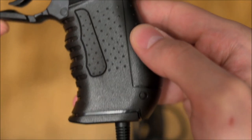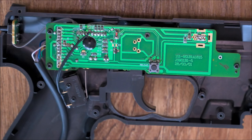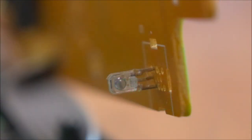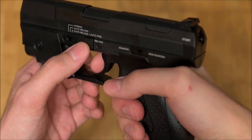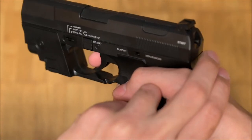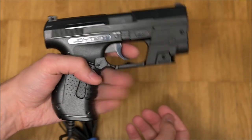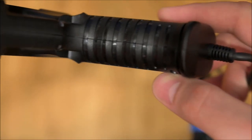I tested two TVs and on both machines calibration was an issue. Opening the gun, I can see that the light sensor is grossly ill-placed, which might be the explanation for the necessary calibration offset. The sensor was soldered directly to the board without a holder, spacer, or similar device, which presumably gives its location a large statistical variance. The good news is that relocation of this sensor would potentially remedy the calibration offset issue. In normal gun mode, the accuracy is surprisingly good — I was not able to spot inherent dead zones and the gun calibrated fine.